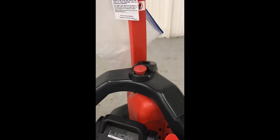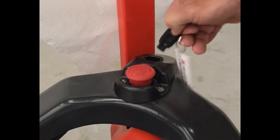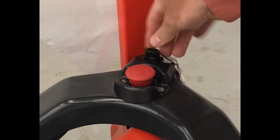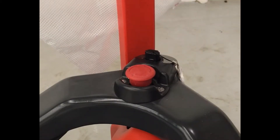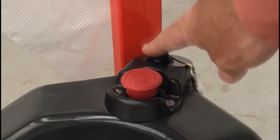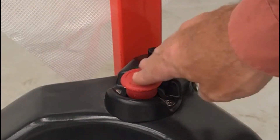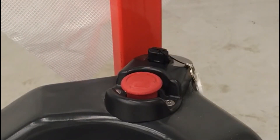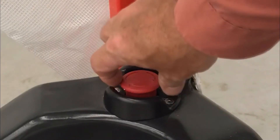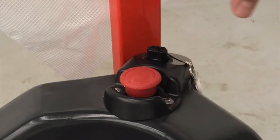With the battery inserted into the unit, it is time to insert the key. The key is magnetic — it is very simple and just drops straight into this small slot in the back. You will hear it click as it goes in correctly. This is your emergency safety stop. That is for emergencies only — it is not to turn on and off the unit, as you can break it, and it is costly. If you continuously push down to shut off the unit, it must be twisted slightly clockwise and the unit will have power again.